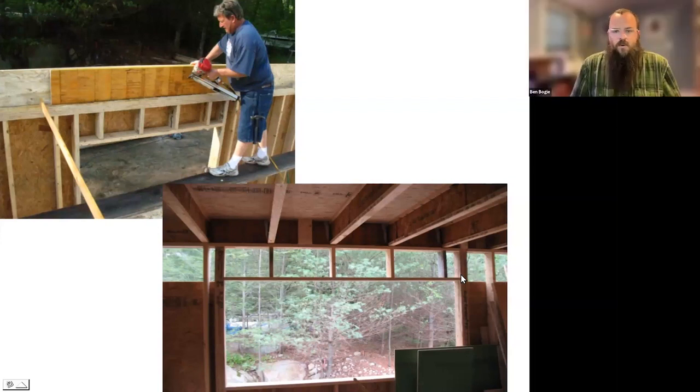Some people prefer the drop header. I like to put as many headers as I can in the floor system because I get fewer drywall cracks at the upper corners of the window or door opening, especially on larger openings. We have a house right now where all the openings are taken up by the 16-inch LVL rim board around the project. We really like that because it means we can insulate that area much better, and fill the ends of those floor joists with more insulation. Putting them in the floor system also means that later when somebody remodels, they can do kind of whatever they want.